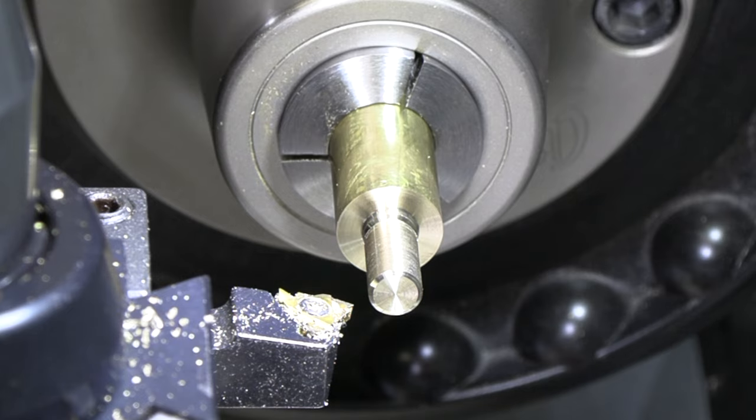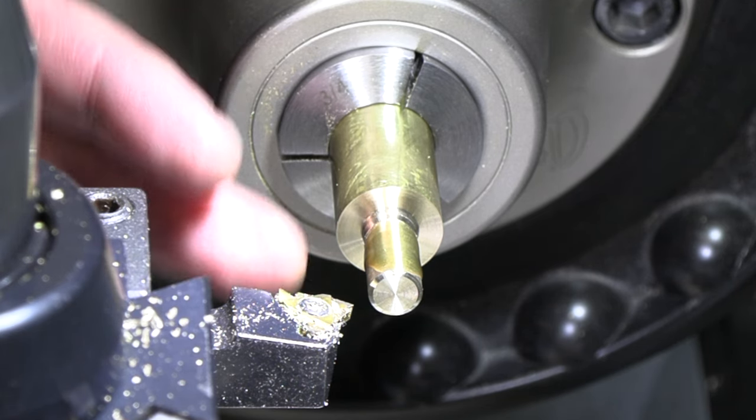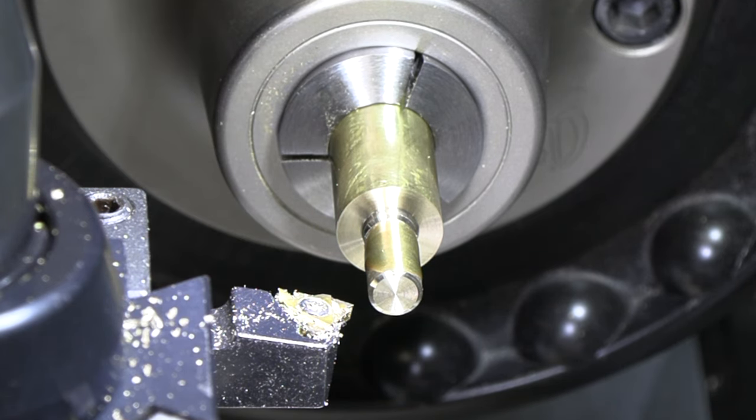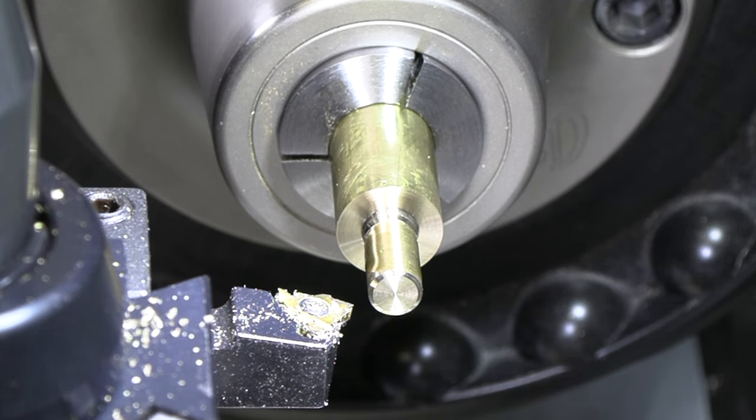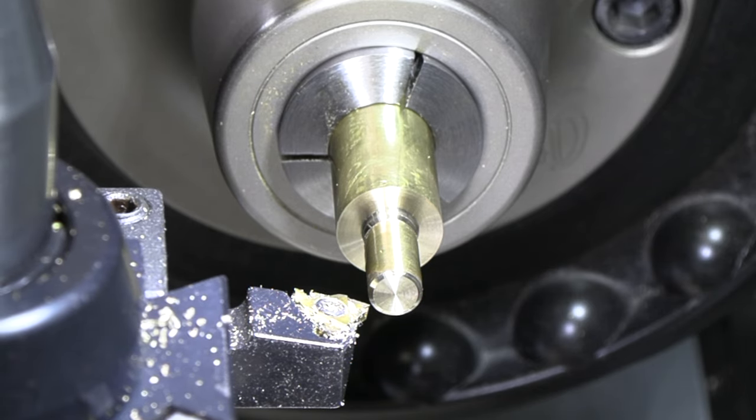I think that feels pretty good. So on my machinist app for thread passes, says first one will do about 20 thou, 17 thou, and then about 10, and then sneak up for that last pass. Probably do a couple spring passes to get this done. So it should be about 5-6 passes to get our thread in here. So let's start with a 20 thou cut.